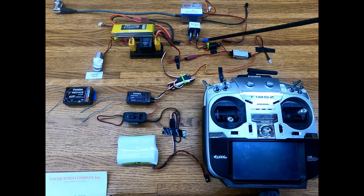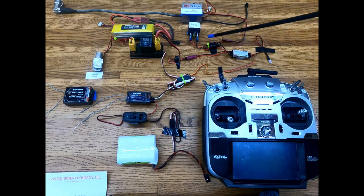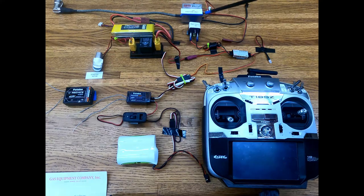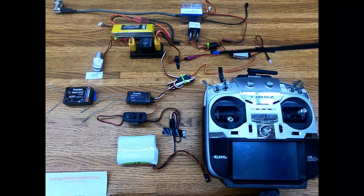So on our mag kill it's 12 volts. If you use an ignition which is 12 volts, you can tie it down here instead of the mag kill. Everything runs off your starter pack, which only gets used for like 4 or 5 seconds on the start. Your ignition doesn't really use that much, so you can use that battery. If not, you can run it back to your receiver and pull off 6.6 volts from another battery if you want to.